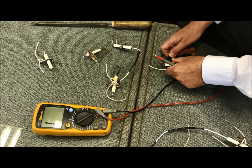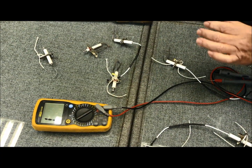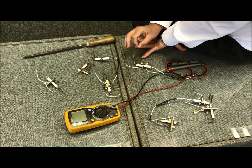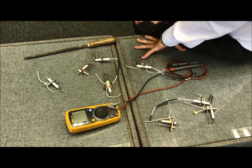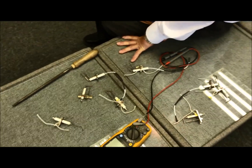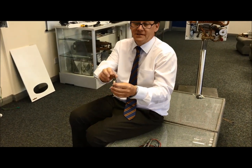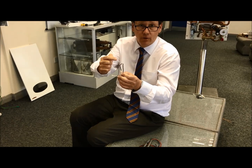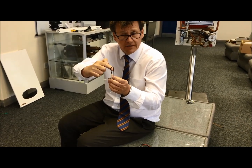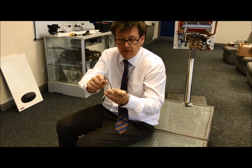This is a build-up of carbon. There's approximately 10,000 volts generated for that spark — the current is very low but the voltage is very high. In 99.9% of circumstances that voltage will penetrate the carbon, but if the carbon is allowed to build up, instead of sparking across the tip it will look for an easier life — moving to where there's no carbon. If not serviced, the spark electrode drops down and can end up sparking much further along the electrode.